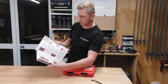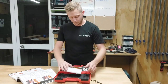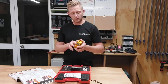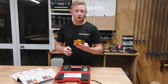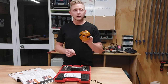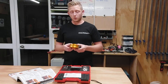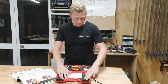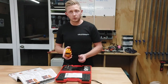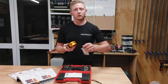It comes with all these different cutters in the book and it's really good. I have used this one before but I needed one for my own shop and it's quite economical. It's a nice sturdy light alloy head, manufactured in Italy and imported for me. It's a 100mm diameter cutter, 40mm thick with a 31.75mm bore, and it all comes in a nice case — everything's rugged and has a place where it goes.